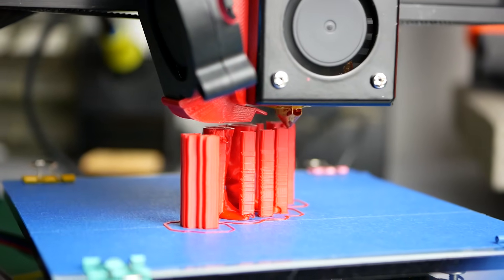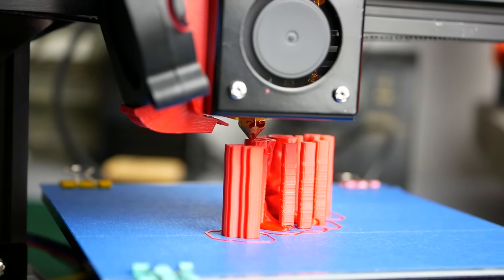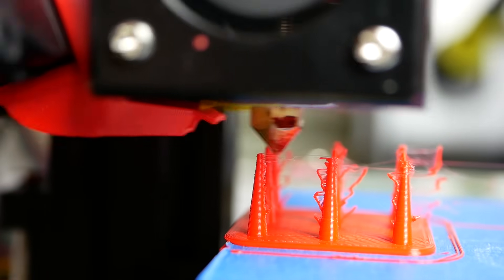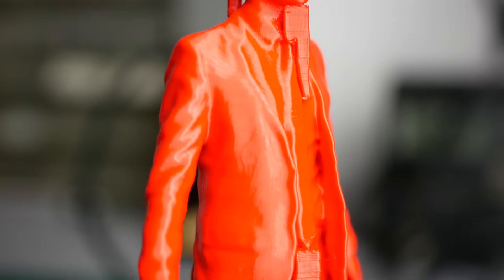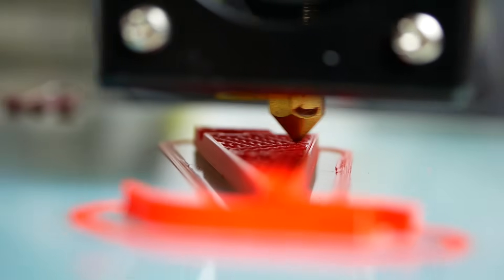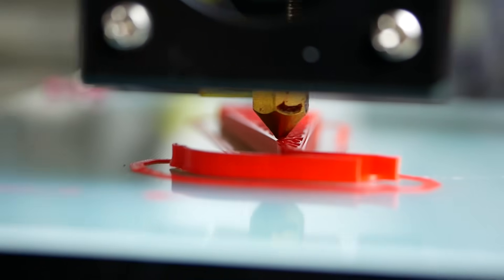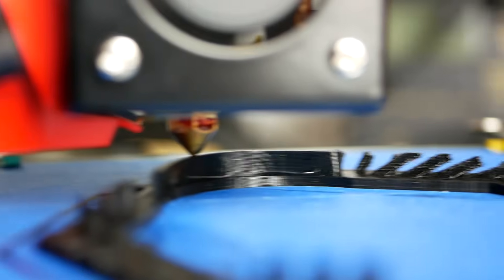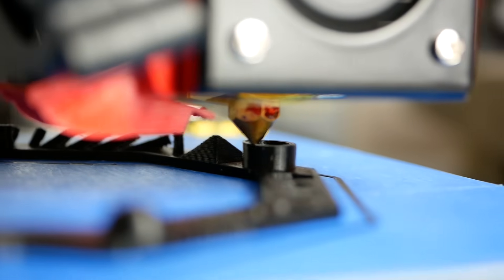Let's sum everything up. The CX-1 is definitely not an original Prusa or an Ultimaker. It does have a couple of flaws, but what can you expect from a machine that is only a hundred bucks? When you add a fan and tighten all the linear rails, the printer is able to produce some really nice looking prints. In my opinion it's well suited for a beginner who has some tinkering skills, or even a child under guidance, since it's easy to assemble and doesn't require you to play around with dangerous voltages. So if you want to start the hobby, are looking for a gift, or just want a spare printer, the Tronxy CX-1 is definitely worth looking at.